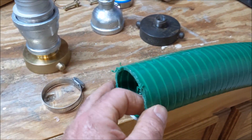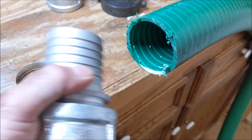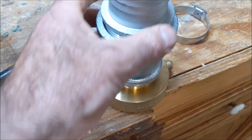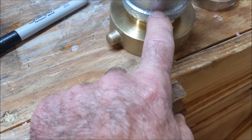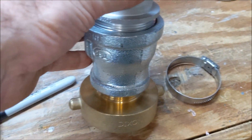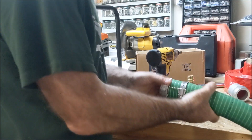Back from the plumbing supply store with a ton of fittings. This is my two-inch PVC non-collapsible suction hose. Here's one fitting with a hose clamp — this bell housing is the only thing they had. This is fire hose thread from my hydrant — one-and-a-half-inch fire hose thread — and then this is pipe thread. So this goes at the end of the hydrant to the bell housing, and then this goes inside the suction hose. That's it!